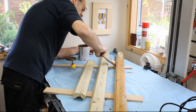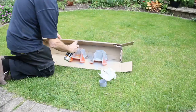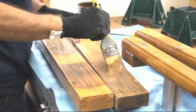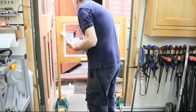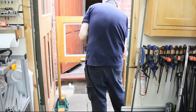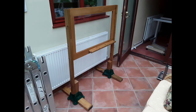The painting was finished off with a bit of Ronseal quick-drying stain — it's a light oak stain and takes about 10 minutes to dry. I gave the bases a spray over with some car bumper spray and a bit of green paint, just to get them roughly in tune with the grass. Then I gave the whole frame a coat of clear varnish — just a bit of Wilco satin varnish — and peeled all the masking tape off. That was pretty much job done. Well, that's another one down. Hope to see you all again next week and we'll try and build something different then. See you, bye!